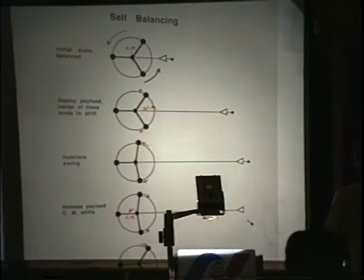Yes. What kind of frequency are you talking about on any oscillation? Incredibly low. So you would have trouble detecting it. Well, you could have a surveyor's instrument in several places looking at corner reflectors everywhere else, or you can measure them with accelerometers if they're good enough. As far as frequencies, if you've been on a suspension bridge, you have some view of it: several seconds of oscillation, and that's what, half a kilometer, quarter kilometer long. Some of these are bigger than that. So there's plenty of time to have the computer run its calculations to help dampen this thing.